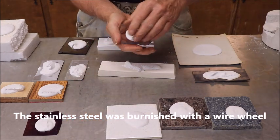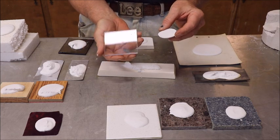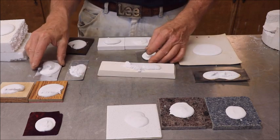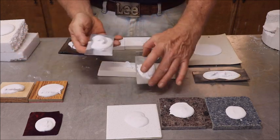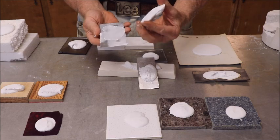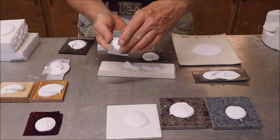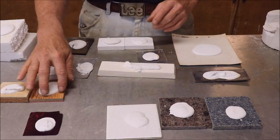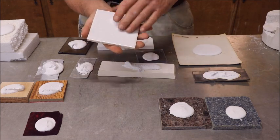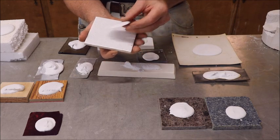How about plexiglass? It comes loose so easily on Lexan or plexiglass that the bottom of the plaster is shiny, so you know it won't stick to that. Aluminum — I took the oxidization off, which is natural with aluminum, and it did come loose pretty easy. Standard aluminum with an oxidized base comes loose pretty good too. A piece of tile — bathroom tile — and it slid right off, and just like the Lexan, it's smooth as a baby's butt right on the back.